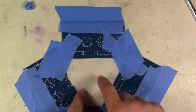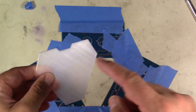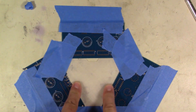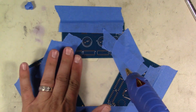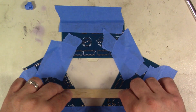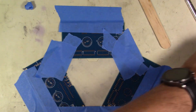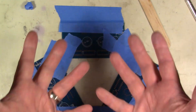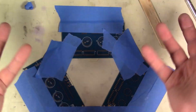So I've got the 3D printed lens here. The only problem is it is too clear. What I'm going to do is I've set up a little jig using some PCBs and I'm going to coat this in hot glue. I'll use a tongue depressor to scrape the hot glue and make sure it's evenly coated, because hot glue dries to a weird opaque color which should help diffuse the light. We'll see how this works — may work, may not. If it doesn't work, I'll just print it again and maybe rough it up with sandpaper.